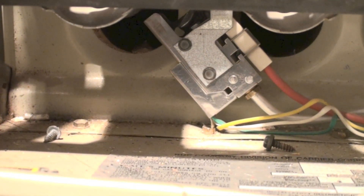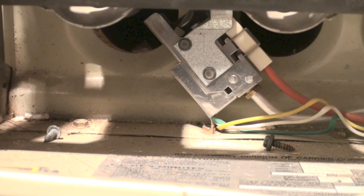That is the pilot. This one is an electric pilot, meaning it lights itself. There are some older ones that you had to light by hand — I'll pick one of those up one of these days and show you how that works. But this furnace has a pilot light because it has the aluminum tube. Just follow the aluminum tube to the pilot. That's the difference between a furnace with and without a pilot.